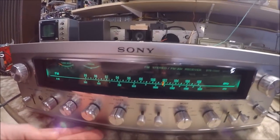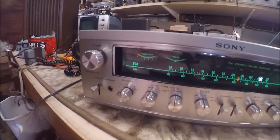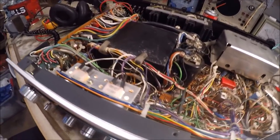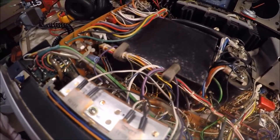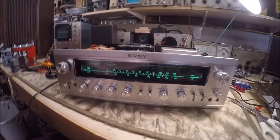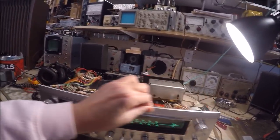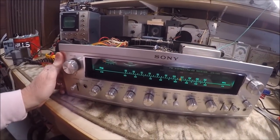and they did a nice job. But the problem is, when you're switching out the LEDs and you're not properly calculating the resistors needed to reduce the voltage to make that work properly, then you create havoc, and something obviously went bad. Okay. Now, that was the story that was told to me.